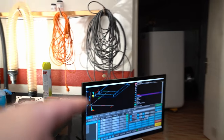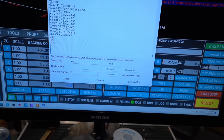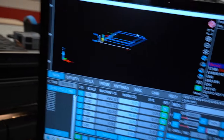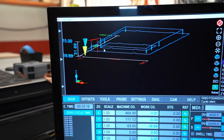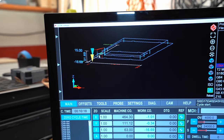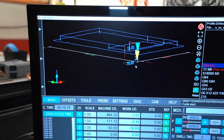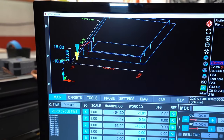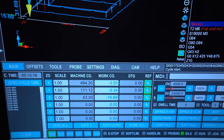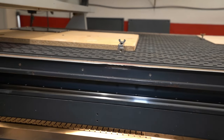And of course, I will take this line out of the G-code. So we just have to remove that line and we are done. So now, yeah, it's disappeared. Believe it or not, this is a very good thing. The UCCNC looks to me like a very good software because what you see in the simulation, exactly this is what you will get. So now I don't have this crazy 50-something millimeter deep machine destroyer toolpath. So now I can do real zeroing. So first for that, of course, I will do home all, reset all the motors and all the heights.